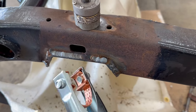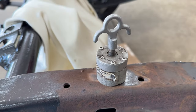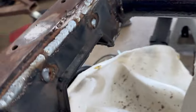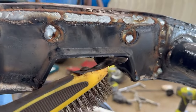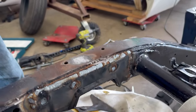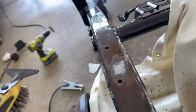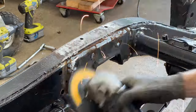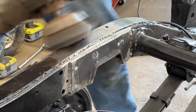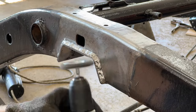Once I welded on the area that I was using the clamp on, I had no other surface to grip with the edge of the clamp. So I've got this magnet here — I can just grab onto that and still have good ground. Some of the paint on this bracket is peeling off just from the heat when I was welding it, so I'm going to go over this with the grinder and then a wire wheel to remove any loose paint as well as any of the original rust from the frame. I used a smaller drill attachment to reach the tighter areas that I couldn't get into with the big wire wheel.